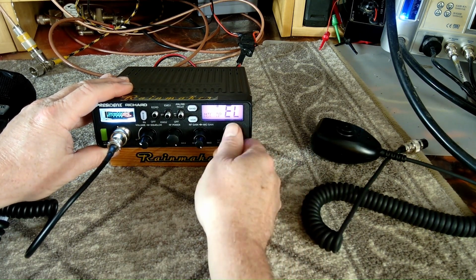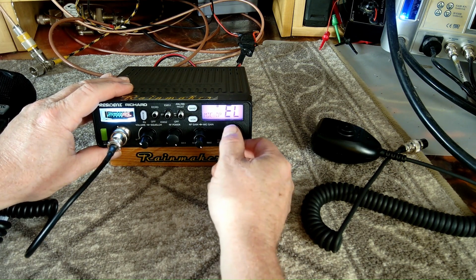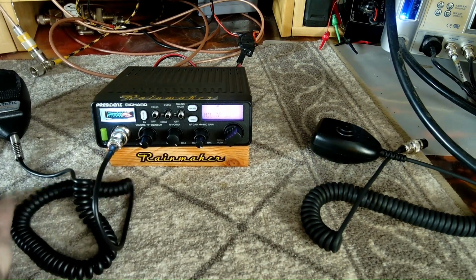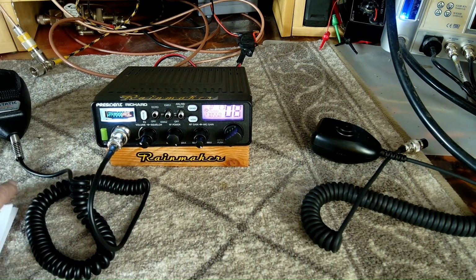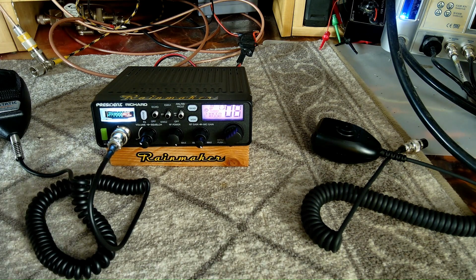I kind of figured it was going to be pins 1 through 4, and it's actually pins 1, 2, 3, and 5 that you'll actually use for wiring a standard mic. All right, and that information is found in the back of the book, or back of books, since I actually give you multiples here. There is a small diagram, and I'll read that off here real quick as soon as I find it in the book. That way, for somebody that doesn't have the book, if they need to try to find the wiring schematic for the regular channels.